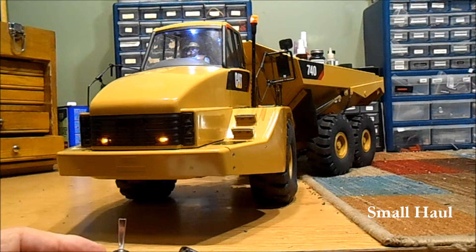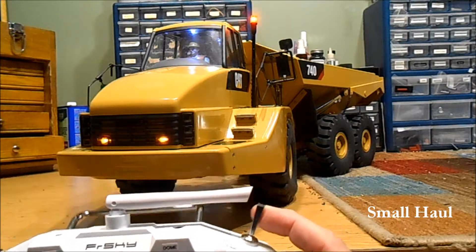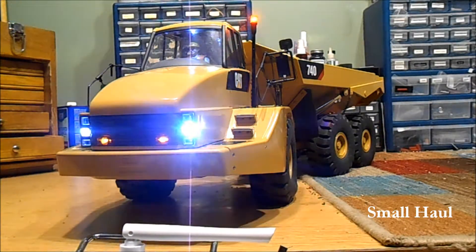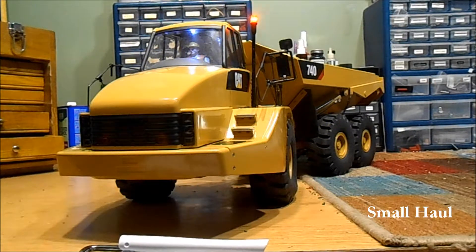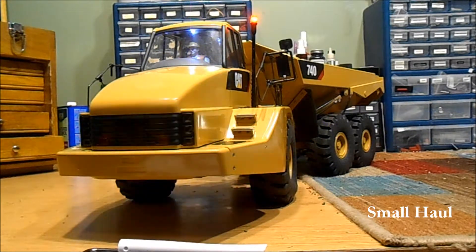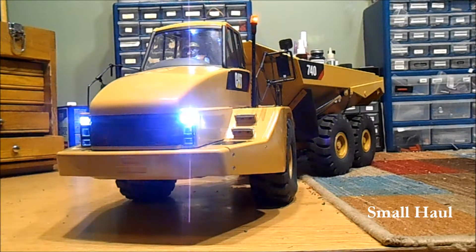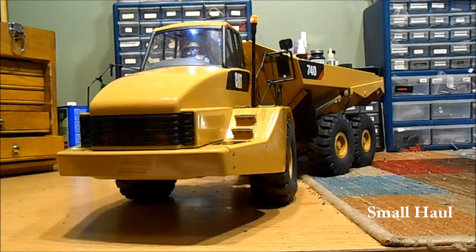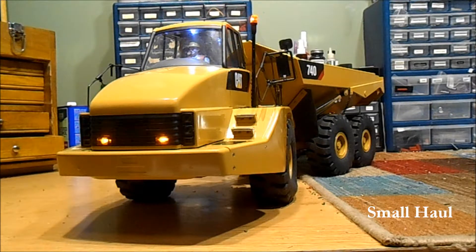Put your four ways on, and then the right rear switch is your flash — it's a momentary switch where you can choose all the different flash modes. I always leave the four ways on when going through the flash mode, that way I know I've exited the flash mode when the four ways come back.